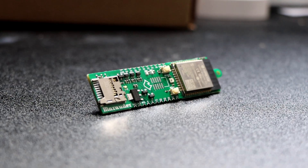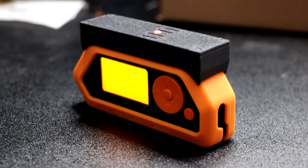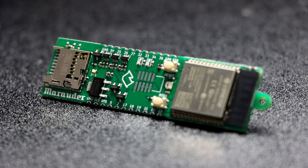If you've been keeping up with me on Twitch or watching my shorts, you've probably seen the development board that TriSphere and I have been working on — it's called the Wi-Fi DevBoard Pro. The form factor is much smaller than the official DevBoard. It mounts to the Flipper differently using header pins that let the board sit flat against the Flipper body, whether you have the silicone case or not. It mounts in a 3D printed enclosure with a light pipe for the status LED, comes with a micro SD card slot, a JTAG interface, and broken-out GPIO. I plan to sell these on Tindie with the Marauder firmware pre-installed.